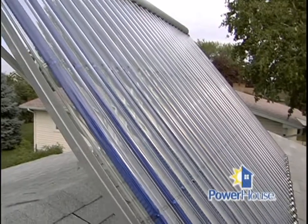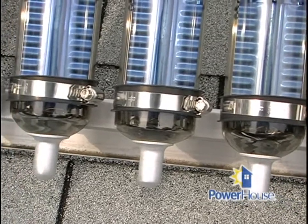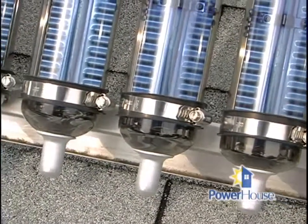What about maintenance for a system like this? A well-designed system really is maintenance-free. There are only a couple of moving parts — the circulating pump and the heat transfer fluid flowing through the pipes and panels — and it should be inspected every 10 to 15 years to make sure it's protected from freezing here in the northern part of the country. This could last a very long time — in the 40-plus year range, definitely longer than the shingles themselves and longer than a lot of other things on your home.